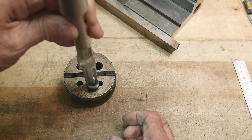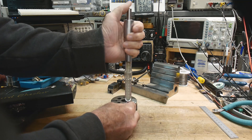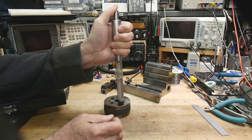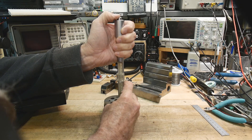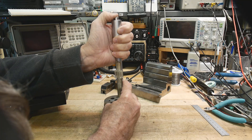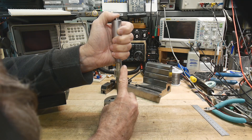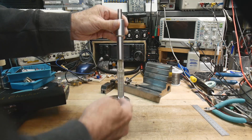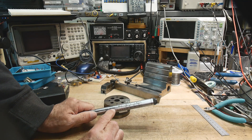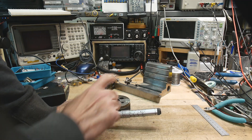So let's go ahead and do that. I'll put it down on a surface here and release the plunger. You can see it came down and bounced. I need to get down to eye level to read it. I'd say about there is probably the average for the bounciness. If you turn it to the back, you can read off the hardness scales — Shore, Rockwell, Brinell, and Vickers. Rockwell is what I understand, so this is about Rockwell 61.